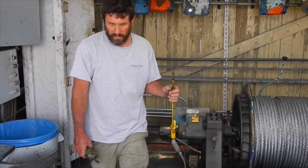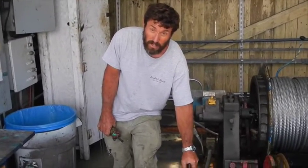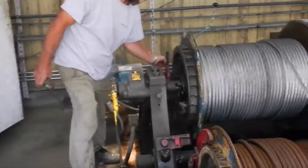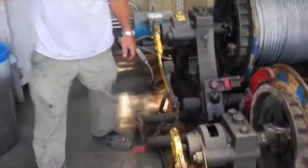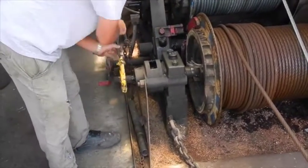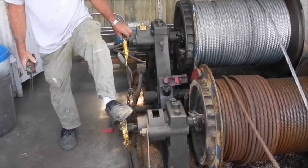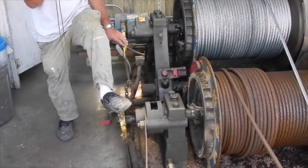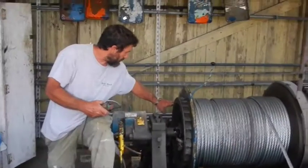Once you've reached the roll-down point — in other words, you're on gravity and you do not need the secondary wire to pull the boat onto the ways — engage the clutch. Hold down the foot brake, engage the dog. Lock the clutch lever. Disengage the secondary clutch lever. Hold your foot over the secondary clutch lever and bump it forward just a slight bit. This will allow you to disengage the fully loaded main dog clutch.